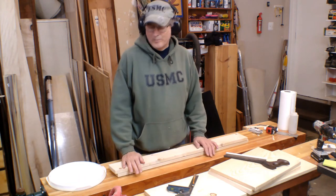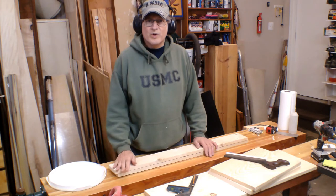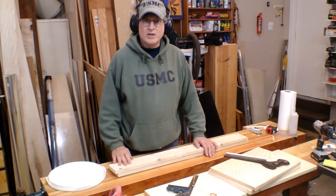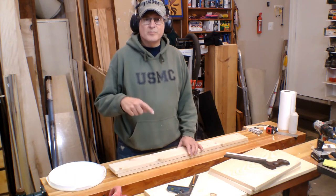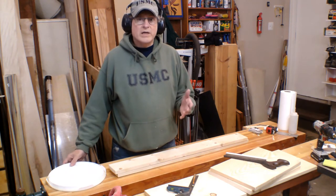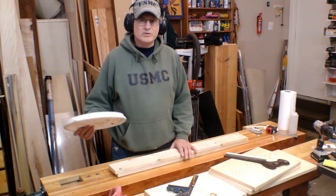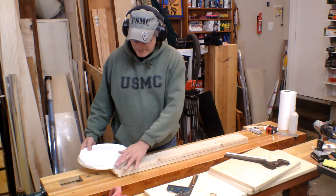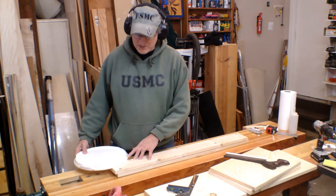Parts are all cut. We're ready to go. At this point, I want to do some layout — I'm going to lay out my curves. I'll take a check of the plans; they're in the link below, you'll have to go to my blog to download those. It's a 5.5-inch radius, roughly. I'm not going to bother with that — I'm just going to use this top, lay it in tangent here, about 4 inches, and rock it to the right spot. That should be good.